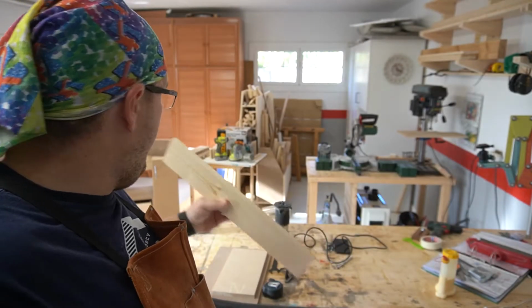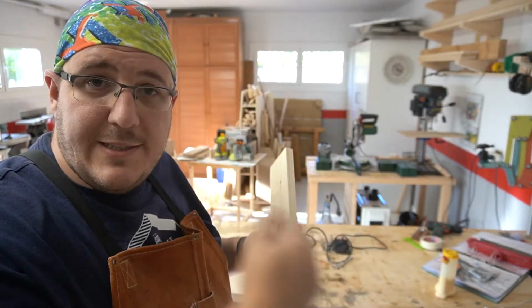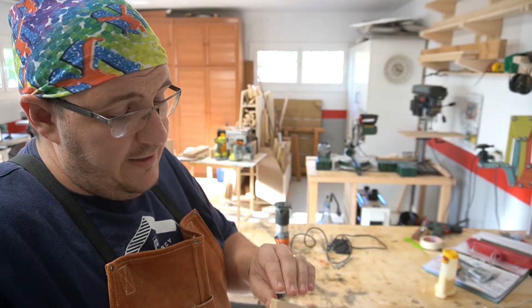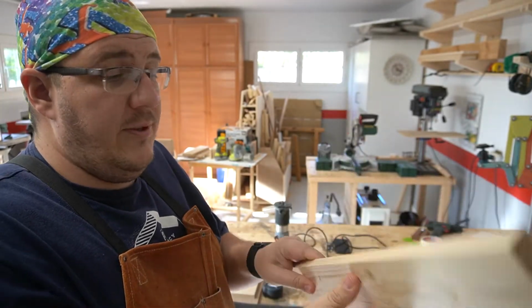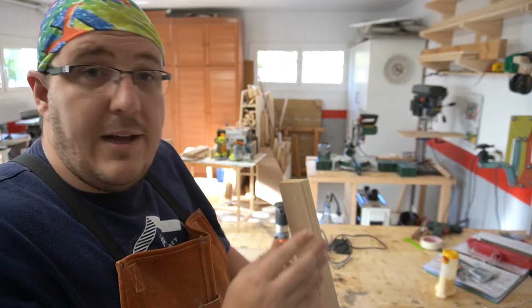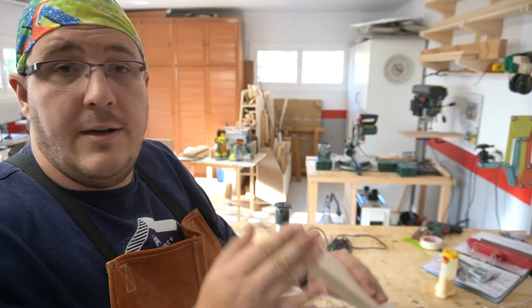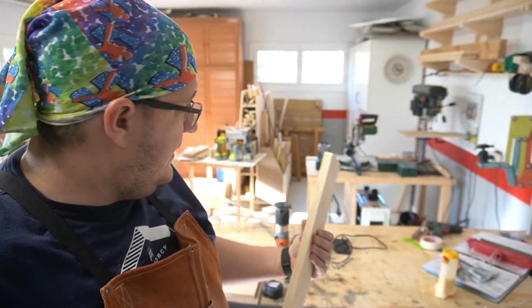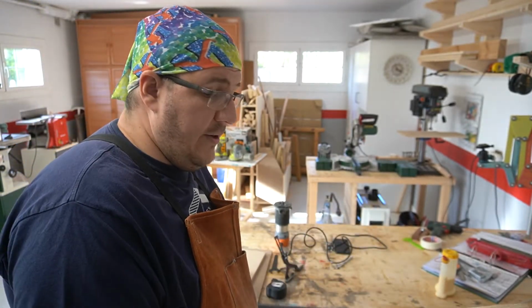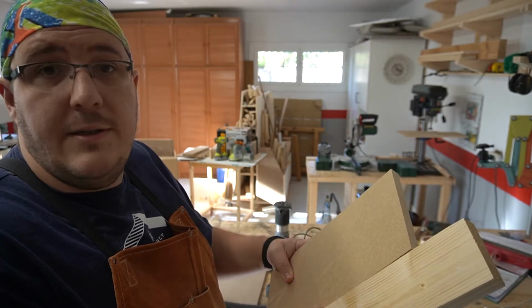So at the top and the bottom of the drawer fronts, I need to put edging on, which will be the same depth as the drawers, just so it looks kind of nice. I'm just gonna use a bit of this wood because it's a bit stronger than MDF for that. So I'm gonna do roundovers on both sides and then cut the right width. This is the same width as the MDF already, so all I do is glue it to the front and done.